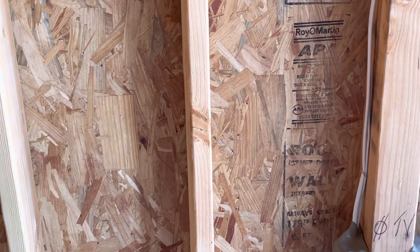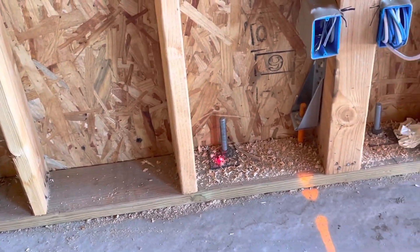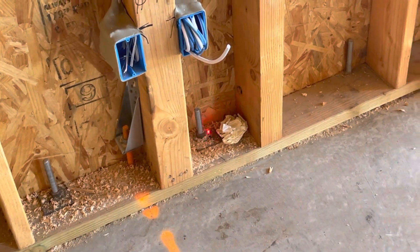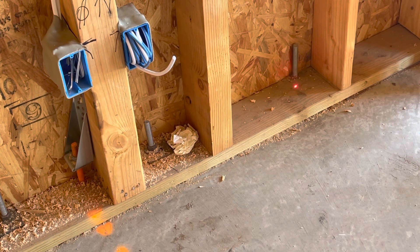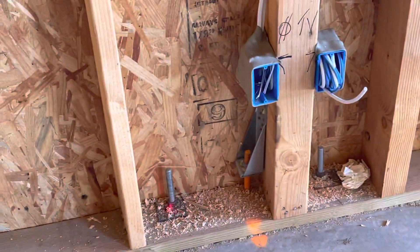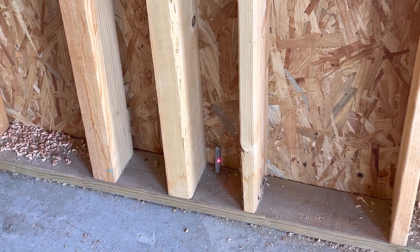You've got your J bolts. See the J bolts all over here — the distance depends on the plans; it's determinative on what your engineer calculates. That one there is obviously going to need a washer, and believe me, the inspectors will come back and follow that up. So there you go — treated wood, hold downs, three-by-six.